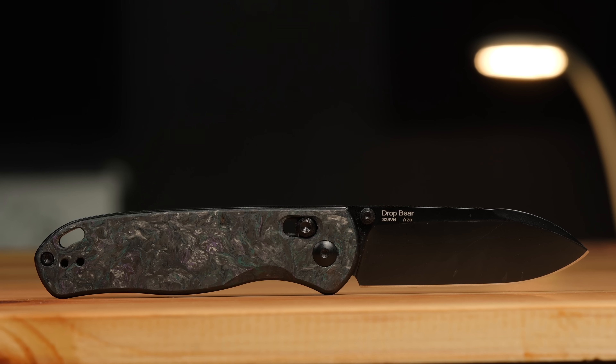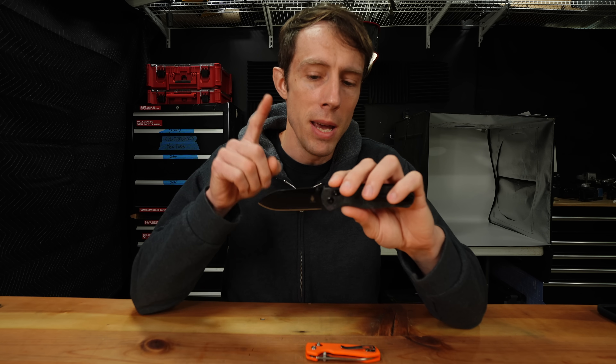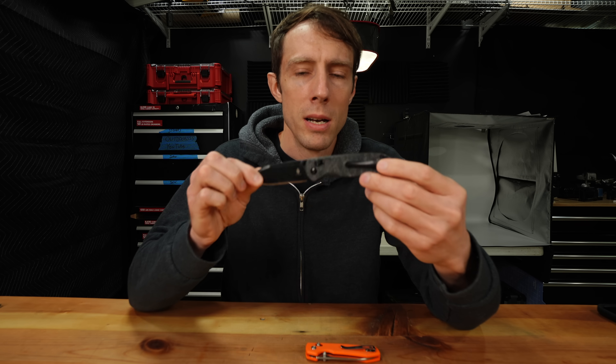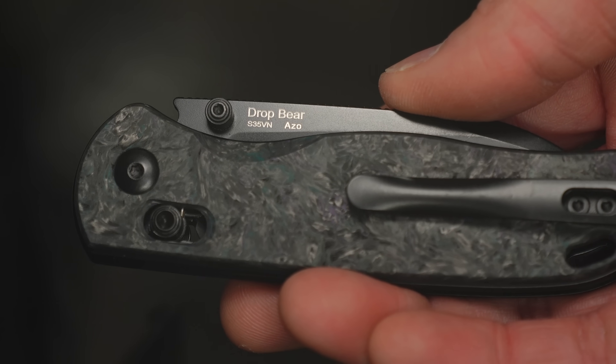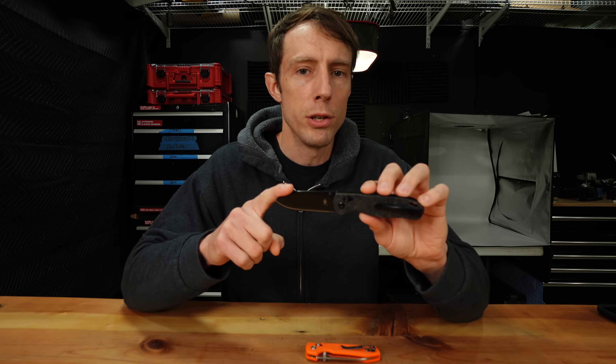I think this is one of those things where you simply can't have everything — there's always going to be a compromise. The problem here is that the compromise we're making is with price. This knife retails for around $160 to $170. They also make versions with other premium materials north of $170, and lesser versions from $110 to $120. This is a premium version with premium materials: fat carbon scales and S35VN blade steel. The problem is that half of those premium materials are not done correctly. There is zero excuse for this blade to come out of the factory at 58.5 HRC. Essentially what you're paying for are some carbon scales and below-average blade hardness.